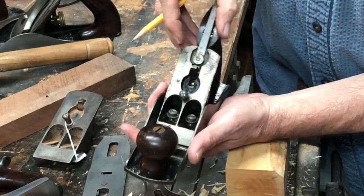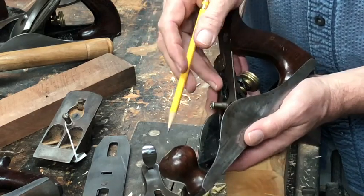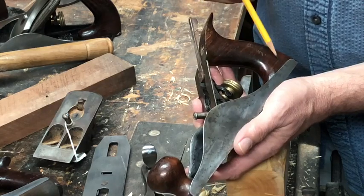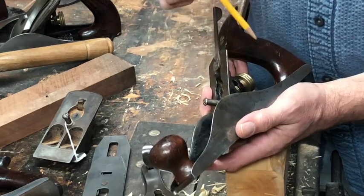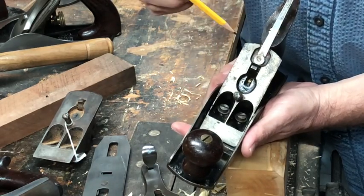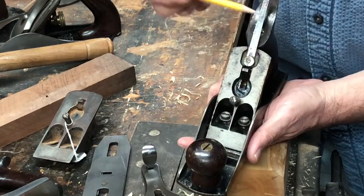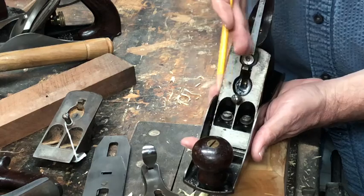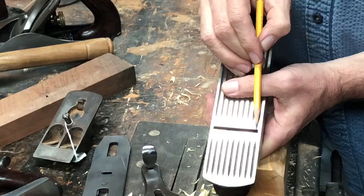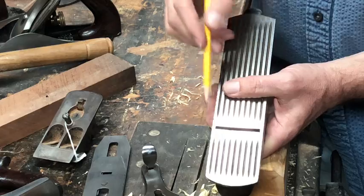Writing on the plane will help you date it, if that's important to you — though it's not always critical. I like a plane with a low knob, and this has a beautiful rosewood handle. But that has nothing to do with how well the plane works. If you're going to buy a plane as a collector, these things matter. If you're going to buy it as a user, what you want is this adjuster here — to be able to turn and pivot the blade. The more you pivot it, the more blade will stick out one side or the other; you want it parallel to the sole during setup.